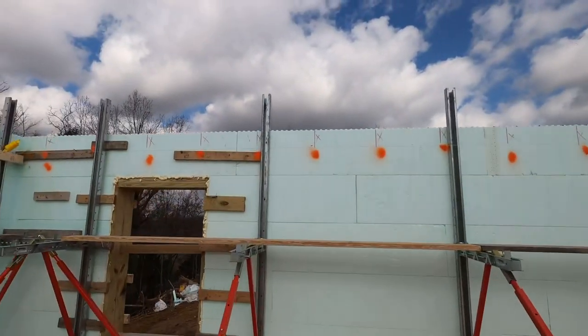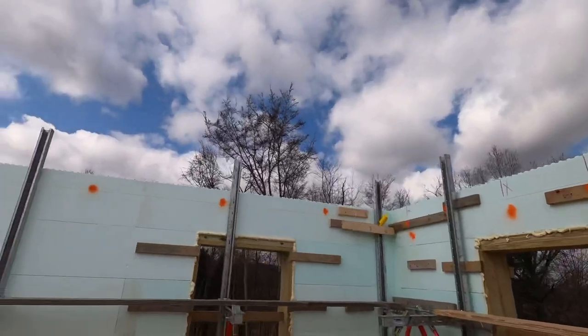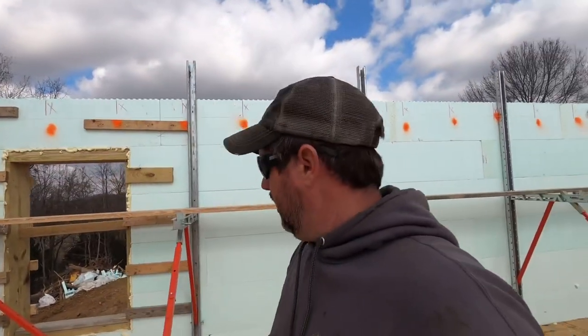You'll be fighting that a little bit around those doors and windows, and you may find yourself throwing an extra brace or an extra stiffener in there to get a little bit of that kink back out. We have gone around again, laid out all of our trusses. We'll put our insert plates in there. If you guys remember from the last job, these dots over here represent where we went around and took the little half moon out. A lot of the same procedures will be in play as far as working concrete underneath the doors and the windows and all that stuff.